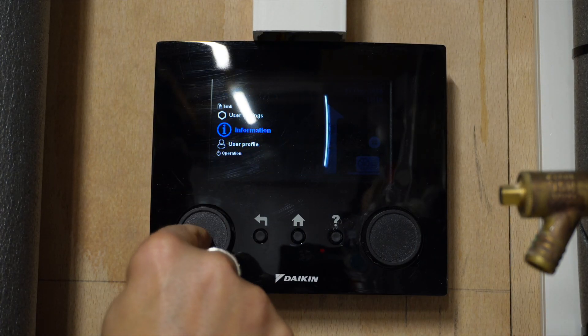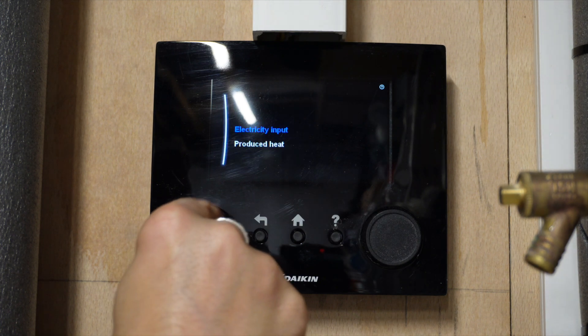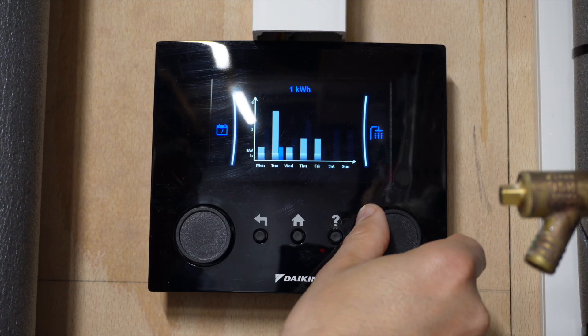On to data collection. If you have a Daikin heat pump like me, you'll be able to view both the electrical energy consumed and heat energy output using the MMI display. If you click the left dial and choose the information menu, you can select energy data and browse through the current and last week of data for both heating and hot water, or the total of both. If you take the heat energy out value and divide it by the electrical energy in value, you get your COP, or coefficient of performance, for that day. This data from the MMI isn't that accurate because it appears to round all of the energy values to whole numbers, but I've been recording this data every week in a spreadsheet.